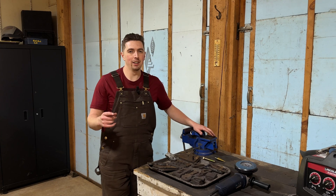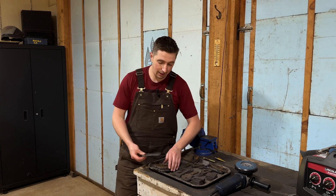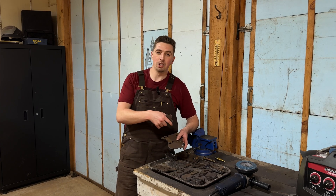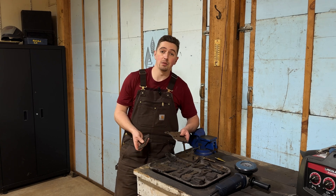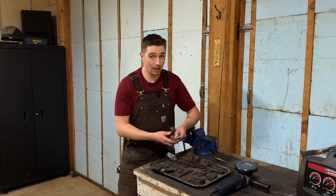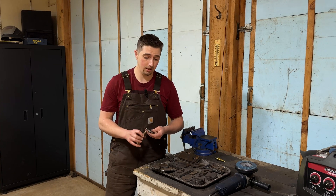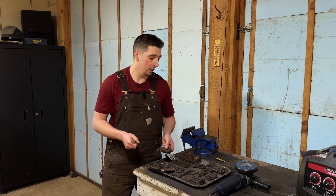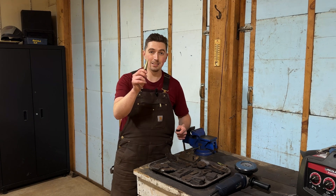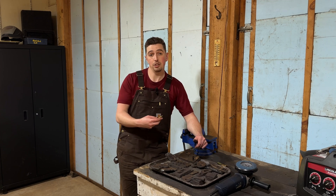I ended up making not one but unfortunately two mistakes when cutting out these link mounts. The first one is I loaded up the wrong set of G-code to the plasma cutter and cut out my previous iteration of link mounts — the one where my tabs were not toleranced properly. The second mistake is that I forgot to clearance my holes properly. My fasteners are 5/8ths and I ran a 5/8ths hole when I cut it — I should have done 11/16ths for clearance. The only drill bit I have kicking around for that size is a step drill, so we have a little bit of dirty work to get done before we can move on to tacking everything together.